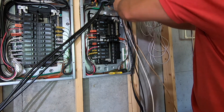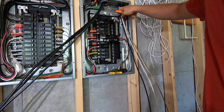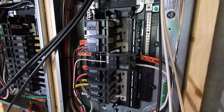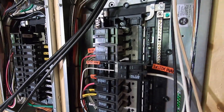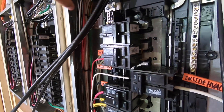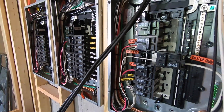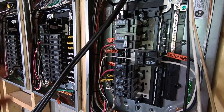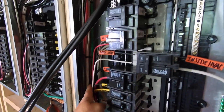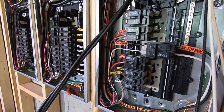Then just cut the top off — very carefully, you don't want to cut the wire. Running this wire was an afterthought, so I'm going to run the grounds as close as I can with the other grounds so it still looks clean. Whenever I'm doing a sub-panel like this, I always do my grounds first in the back, then my whites, and then hook up the power blacks.